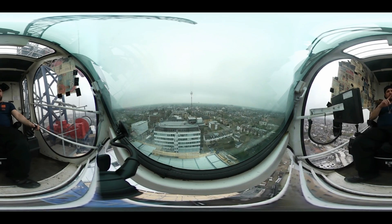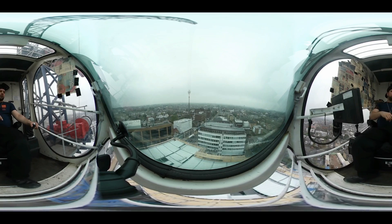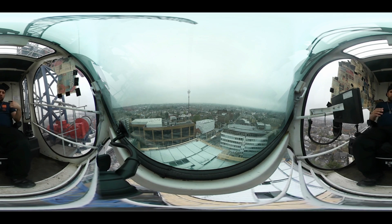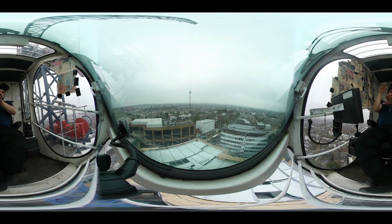You see he's moving, he's passing the jib, and then he stops - then the jib is constantly moving but only the hook and the load will go and stop because it passes the jib. As you slew, the faster you slew, your load starts to go in and out as well - so it's moving on a wave, the load is trying to chase the top. The top is constantly moving but the load stays behind because it loses momentum. The top keeps going and then the tension swings it back, but it swings back faster than the top, so it passes the top - and then there's no force again, he stops, the top keeps going on top of it.